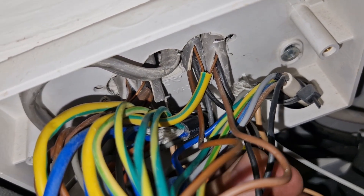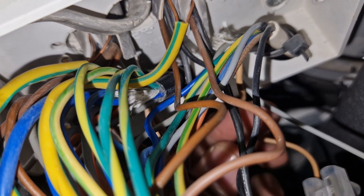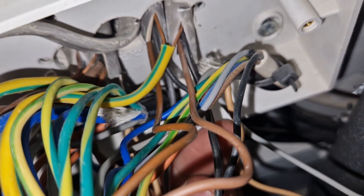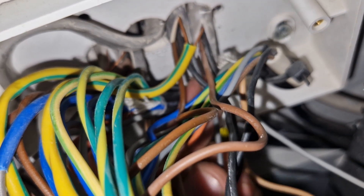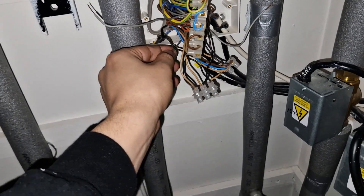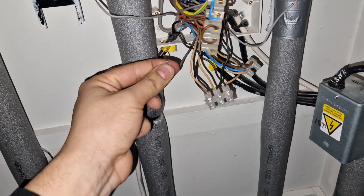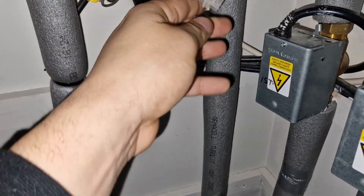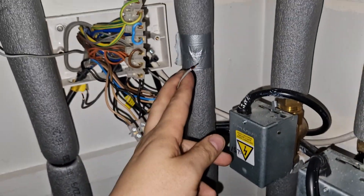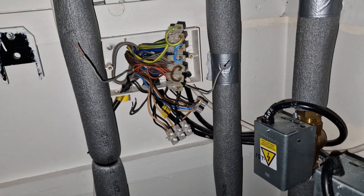So this is terminal three. We've got the brown wire which is going to be the live — we don't need to worry about that. And then we've got the grey wire, which we're going to make the neutral now. So now we know that for all of them, these grey wires are going to be the neutrals. I might as well do all the neutrals now, and then all I have to do is connect up the switch wires.